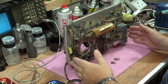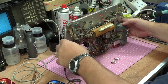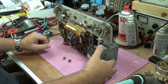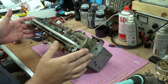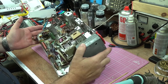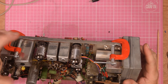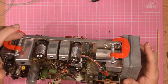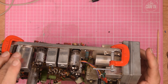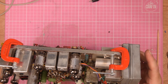I've got it up this way because I wanted some way of holding it vertically and not resting on the tubes or the IF cans, because the whole thing's built on a single chassis as we saw in the last video. So all I've done is put a pair of G-clamps onto the chassis not touching anything critical - they're directly grounded. Obviously if the set is live these do become part of the electrical circuit as well, so we're going to try not to touch them.